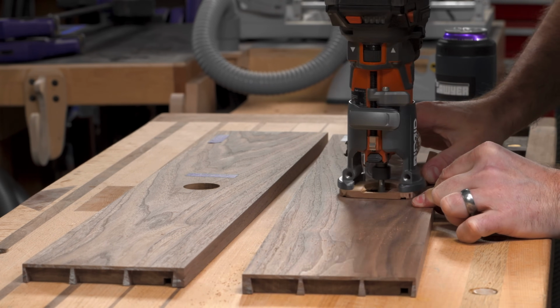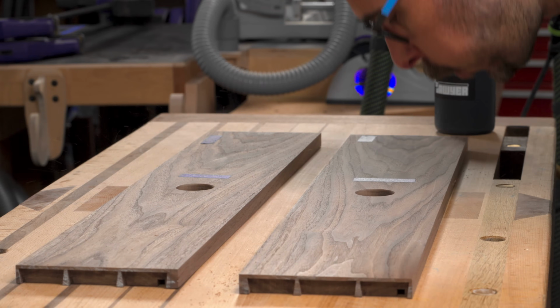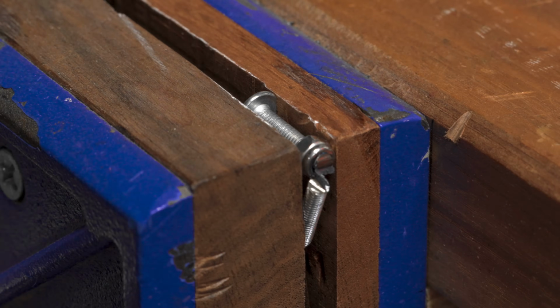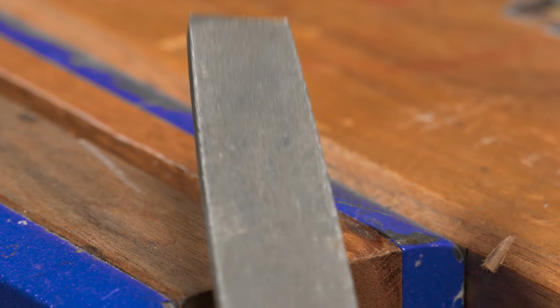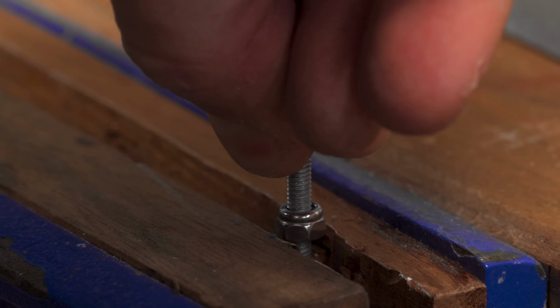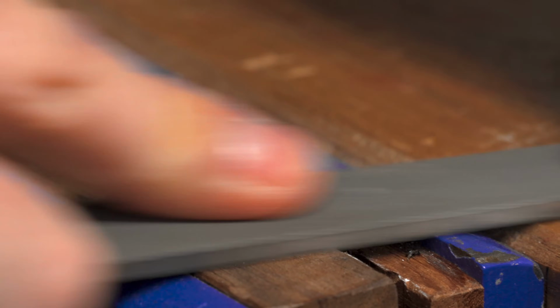This left me with screws for the pull that were too long. By first screwing on a nut, I can grind off the excess of the screw, and unthreading the nut will repair the boogered threads at the end of the screw, making threading the knob as easy as new. That was a hot tip.